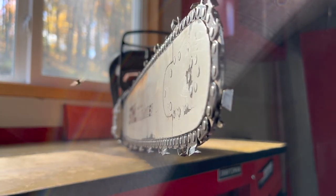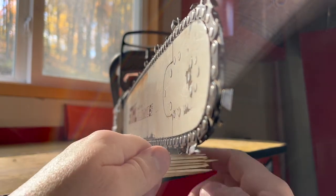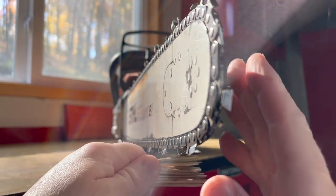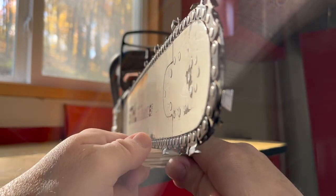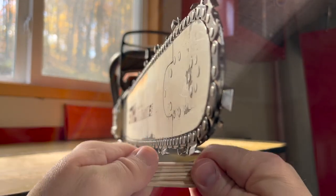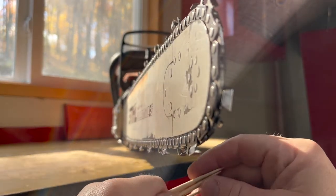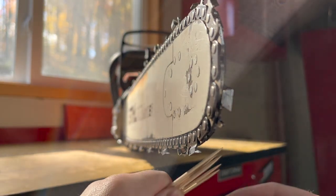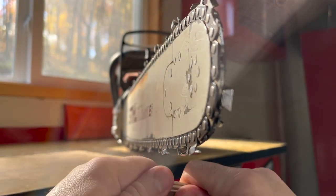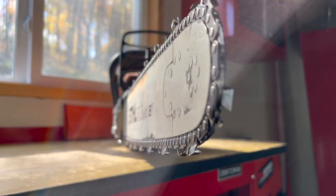You may notice on the chain we alternate side plates — every other cutting tooth has a side plate on one side, then it goes to the other. If your saw has been wandering from side to side or has a preference left or right as you're cutting, that means your side plates are not equally sharpened or are just dull in general. If your saw isn't digging in aggressively that's a top plate problem; if it wanders side to side that's a side plate problem — we'll cover both in our sharpening.